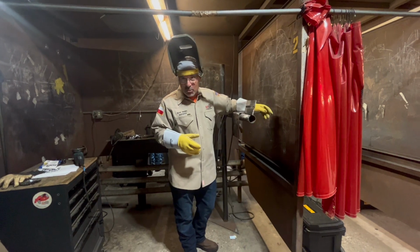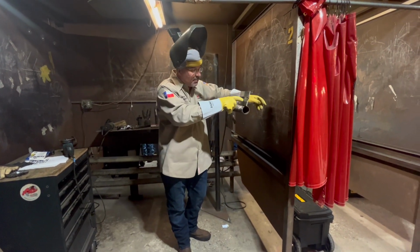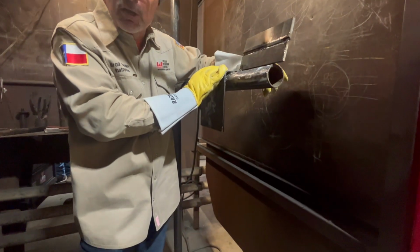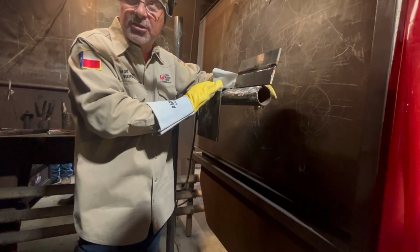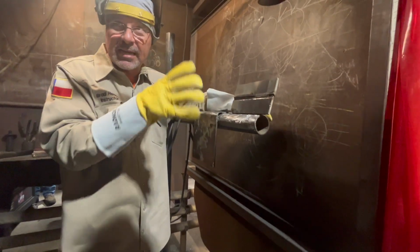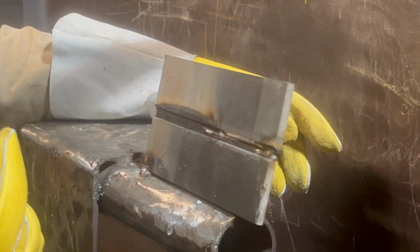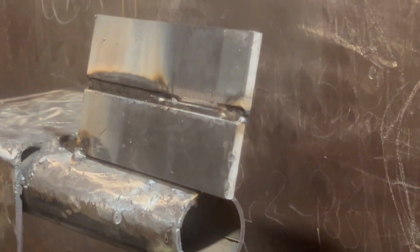I have a flat spot on me. Sorry, I took care of it. I'll bring it down here a little bit. See how many we'll do right there? Let's see you make it thin where it turns blue. If it don't turn blue, it ain't thin enough. You grind on it, it's still shiny silver. It's still kind of thick. Notice too, you don't grind real long, make it about 3/4 of an inch, something like that, okay? But I have to do that so it'll tie in.